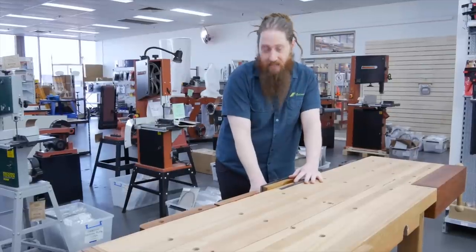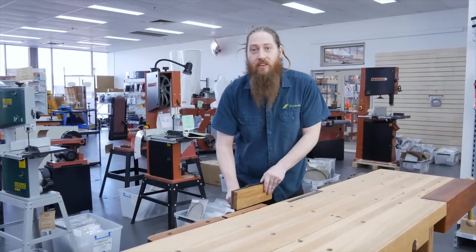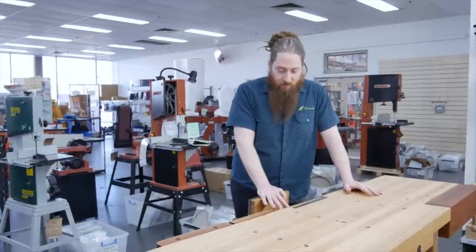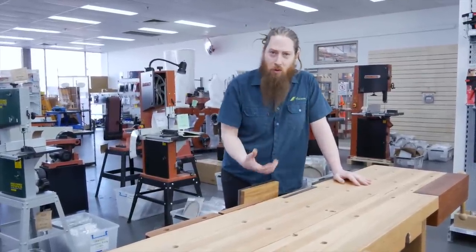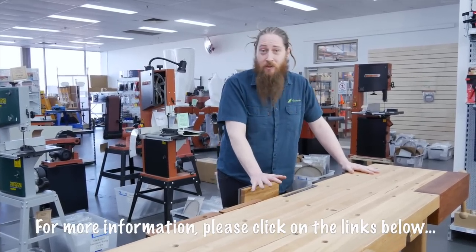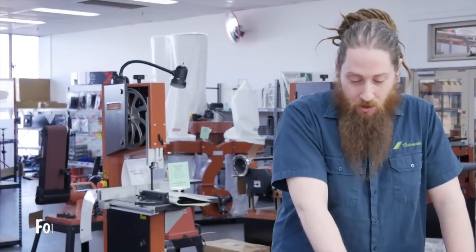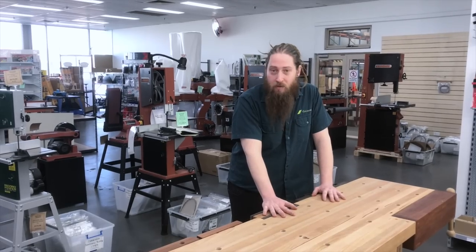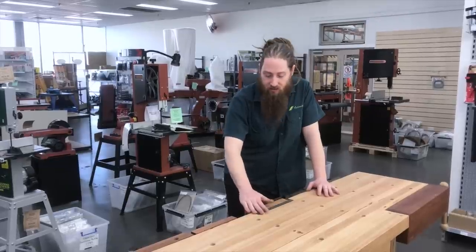With these ones there's also this little lever here — you just push this in and that connects into the quick action system, and then you can open and close the vise jaws very very quickly. Depending on the different workpieces you're actually doing, that's where the different sizes come in. If you're mainly working on smaller pieces then something like the RV 77 is a great little inexpensive vise that is really easy to attach to your bench. Installation on these quick action front vices is very simple — there are a couple of coach bolts you'll need to screw straight into the bottom of your workbench, and you may need to pack it out so that the top of your jaws sit just below or flush to the surface of your bench.